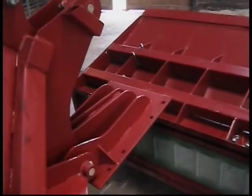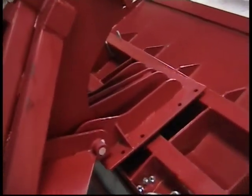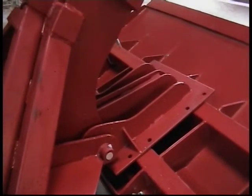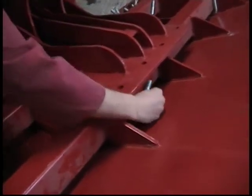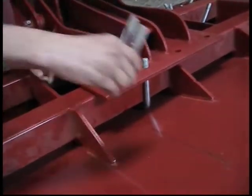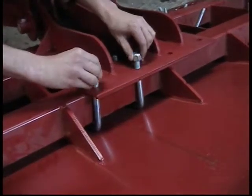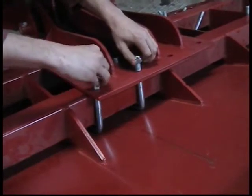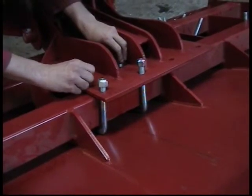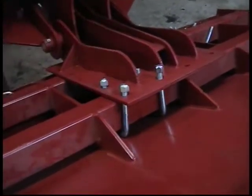Slowly manoeuvre the tilting mechanism to the box section framework of the AG dispenser. Align the holes with the box section. Secure using the 8 U-bolts supplied. Only genuine U-bolts supplied with the tilting mechanism must be used. These must be checked every 50 hours and tightened where applicable. Ensure the tilting mechanism is central to the dispenser and secure.